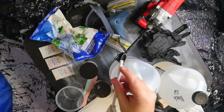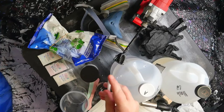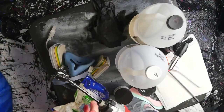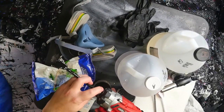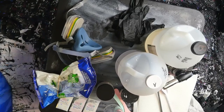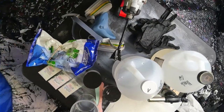Now, this is actually fitted with a quick change tip, so you can put it in a screwdriver, in a drill driver, rather than a drill. It'll work in both, but it's really awesome. Let me demonstrate a quick change tip if you've never seen one of those. So a drill has a chuck on the end, which you undo and open, and the little bits open. This is a quick change driver. All you have to do is pull the end out, and that will come out. Putting that back in, you lock it in, and that's not going anywhere. So the problem I had when using a drill was this bigger one in particular, because it's very heavy, kept falling out. So with the quick change driver, it's not going to go anywhere.